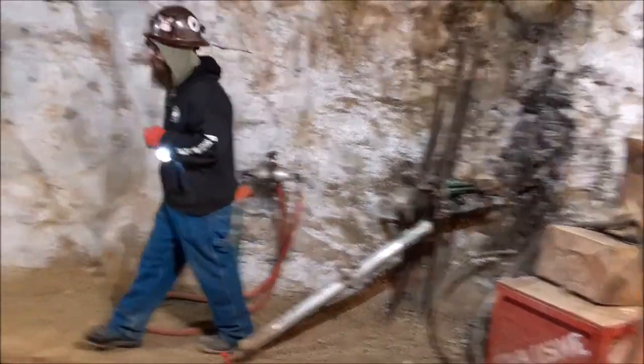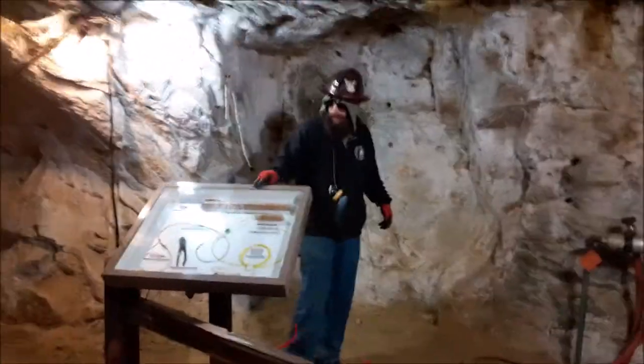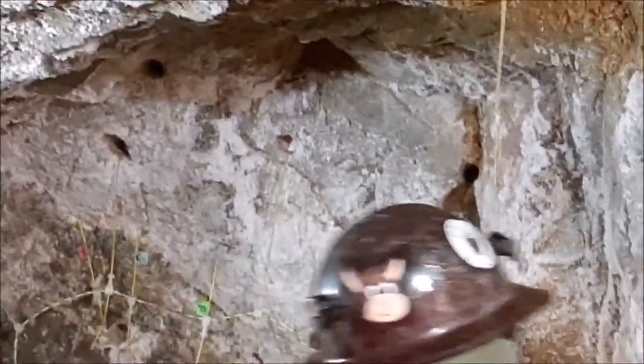But when the 50s rolled around, they changed the form of dynamite to wet gel dynamite. So they'll take this bigger primer stick, cut it into thirds, just like you see below it, and they'll put one of those sticks into each one of these holes, and they seal it up with prill beads or ammonium nitrate, just like you'll see in this jar down here.